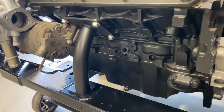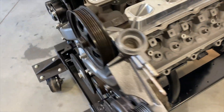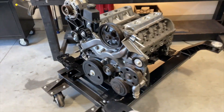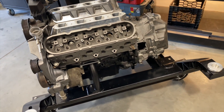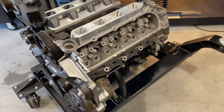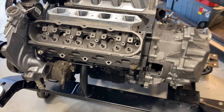This is very similar to the 4080 solid mount that I sell. The big difference is these mounts are intended to keep the engine in 100% the OEM location. Over time your factory mounts are going to deteriorate, they're going to sag, and your motor is going to change alignment in relation to the subframe — and that's a bad thing. These solid mounts will eliminate any movement, put more power to the pavement, more torque down, and hopefully keep things together and alive longer.